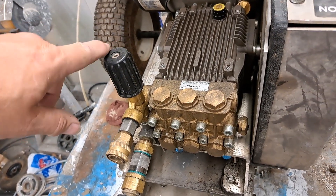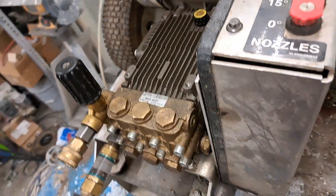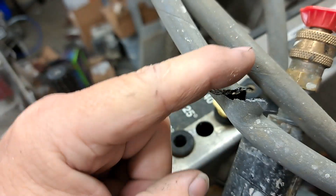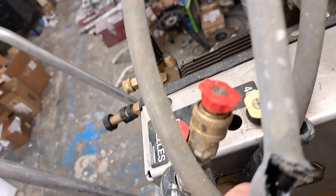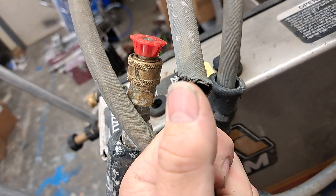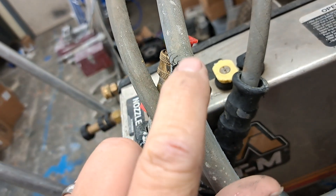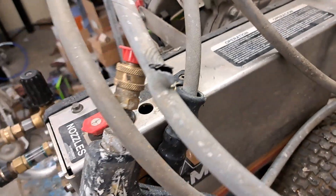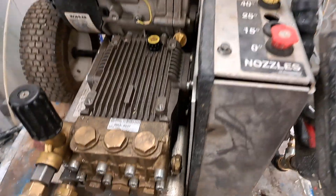This could have been worse — this is the best case scenario of an accident like this. I also want to touch on the steel belts you see here. Over time, no matter how well the outside of the hose looks, the inside can always be damaged. That liner on the inside can get damaged and the steel belts can rust. When they begin to rust, the inside diameter of your hose is restricted, and that can impede the use of your chemical injector as well — so you don't get chemicals through your system like you should.